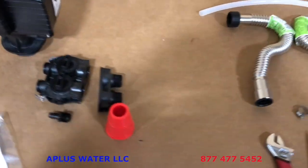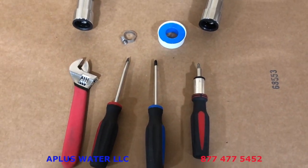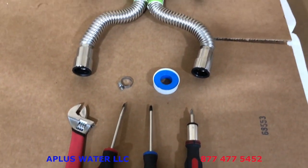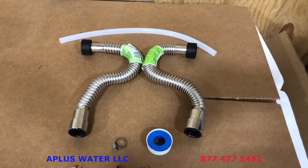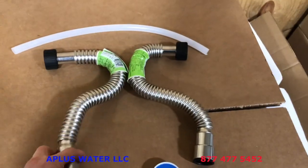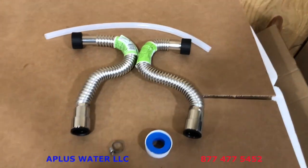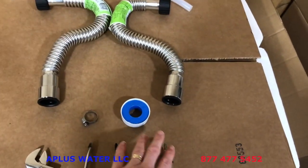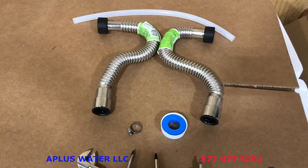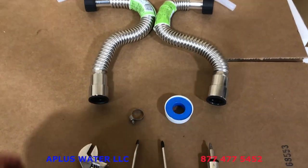There are some things you will need to bring in order to do the install. First of all you just need some hand tools. How you connect your plumbing to the softener is kind of up to you depending on your type of plumbing. We recommend some flexible hoses for the install — that makes it go pretty quick. You'll just need some hand tools, some Teflon tape. You'll also need some sort of lubrication — cooking oil does a great job if you don't have any.